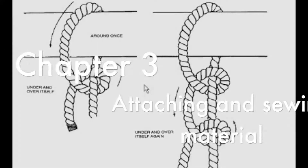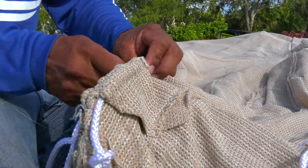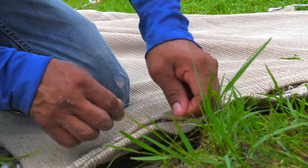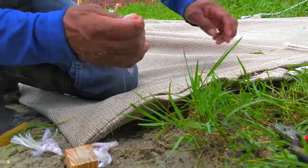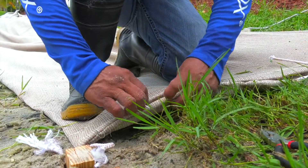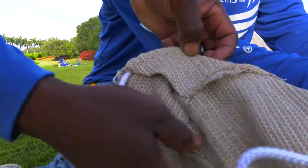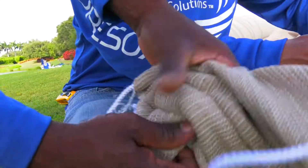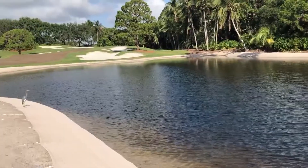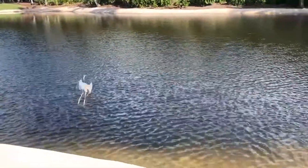Chapter 3: Attaching and sewing material. If more than one section of socks is needed, you will need to sew the sections together to create the proper length to fulfill the required job. In the instance that you are doing just a section and not the entire shoreline, before filling the socks with material, you must sew in your sock ends. When the sock is completely deployed, the first and final section of socks must be sewed to close the system for fill. If the job is an entire lake or pond, the socks must be sewed together and there will be no need to close up the ends.